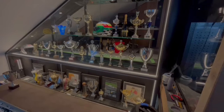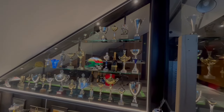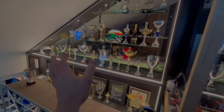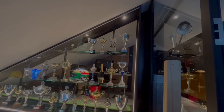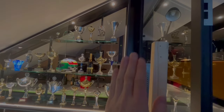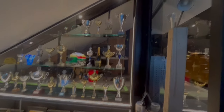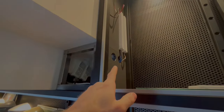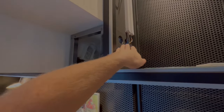I'm going to explain why I don't have all the glass — I'm missing the last one here. I didn't order it because now that the three are in, I'm going to measure out exactly what this one needs to be. I didn't want to take the chance of measuring all four in one go, because this one has to be pushed up to the aluminum list and a little bit down. The aluminum list on the side I didn't glue on because the glass has to slide a little. I'll take the measurement now and order this glass too. I decided to leave it open underneath so some air can go through and it doesn't get too hot inside behind here — that's also why I made those holes.